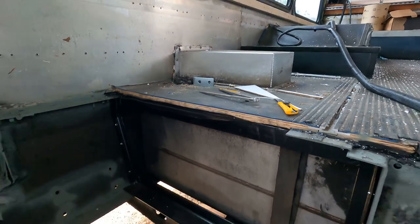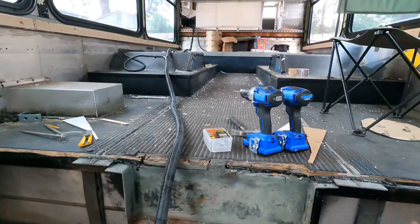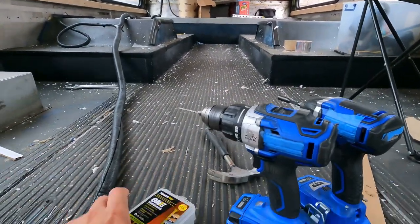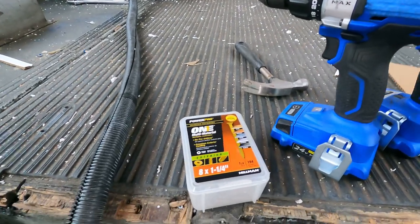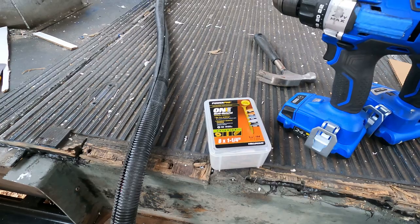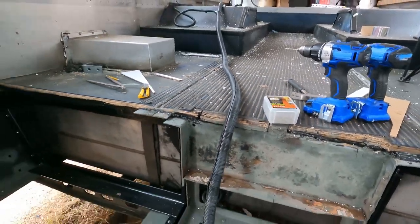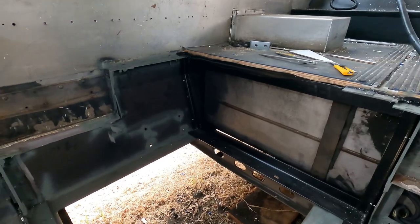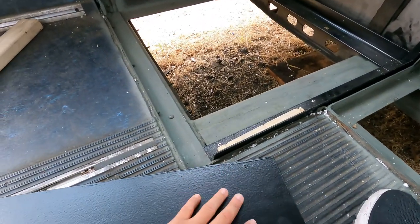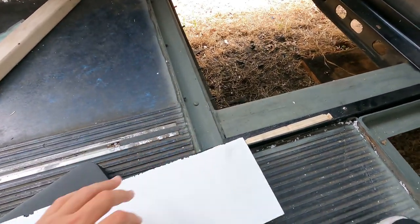This is what I'm going to do now: I'm going to try to fit this panel in here, pre-drill some pilot holes, and use these external-grade screws that can bite into the metal and become flush into this side of the plywood. The screws say no pre-drilling required, but I'm going to pre-drill anyway. Let's do it.